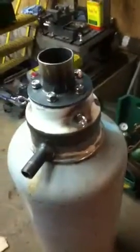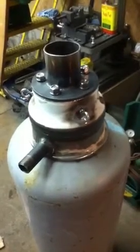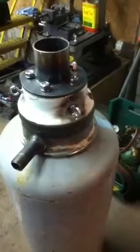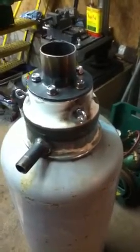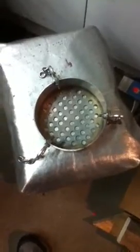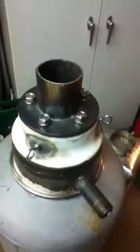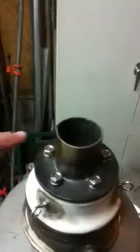What we have here is the burn area — the burn cone of this gasifier. This is actually a rim that I purchased new from Northern Tools. Flash001 shows you how to take that rim and turn it into this. You can see we have our hooks here, our eyelets for our chains that our ash grate hangs from. There's still some work to be done on the shaker assembly, but the chains are mounted and we have it set up one inch from the bottom of this three-inch tube.